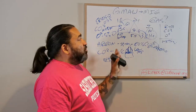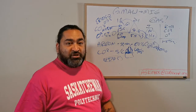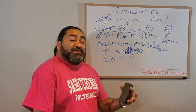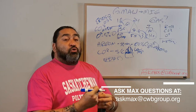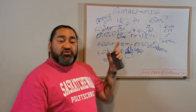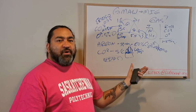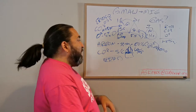So remember, as the heats go up, as the voltages go up, as the amperages go up, slash wire speed, your argon has to go up. And if you want to get the full spray, you want to be up over 80% of argon. Now on the other end, if we're coming down in temperature, we're coming down in voltage and heats, in order to have a successful weld that blends well and actually fuses properly to the colder parent metal, at that low of a temperature, you're going to want to have an increase of CO2 or oxygen in order to account for the lack of fusion or the poor edges that are getting wet. So to increase the better wetting, better penetration, better fusion. All right? Make sense? Okay.